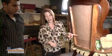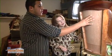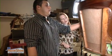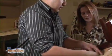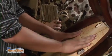Now Luis, this looks like new wood to me. Did you add that piece? Yes, actually this one came with webbing when we first got it. We added the wood to give it more stability on the back, so it will sit more comfortably and probably last longer as well. We took off the old webbing, added this piece of wood, and now this is supporting the foam, which basically supports you.